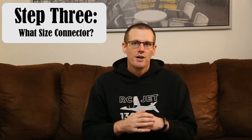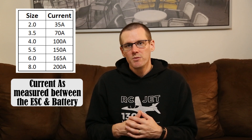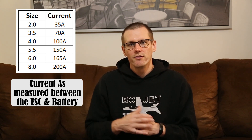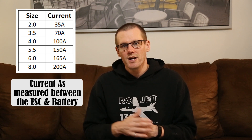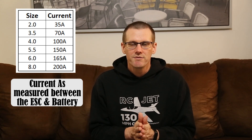The third step is really just looking at the chart — how much power can you actually get away with through the bullet connectors? On the smaller end of the range, a 2 millimeter connector is going to be good for up to about 30 to 35 amps. I use 2 millimeters on anything from just an amp of power all the way up to that 30 amp region. A 3.5 millimeter connector is then going to be good for all the way up to about 70 to 75 amps. The 4 millimeter connector is going to be good for up to about 100 to 105 amps total. A 5.5 millimeter bullet connector is going to be good for upwards of about 140 to 150 amps. Our 6 millimeter is going to be upwards of 160 to 170 amps, and our 8 millimeter connector goes all the way up to 200 amps of continuous current being drawn. That is going to cover a lot of different radio control applications — pretty well 99 percent of them operating within that region.